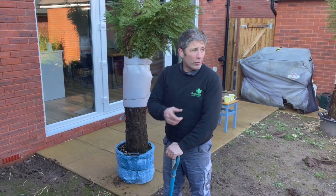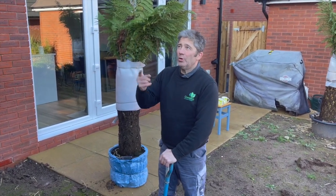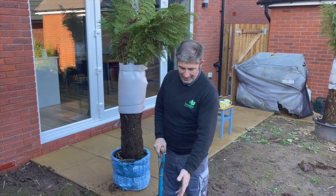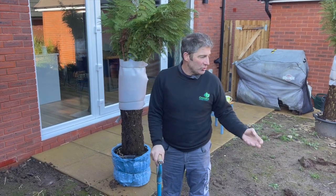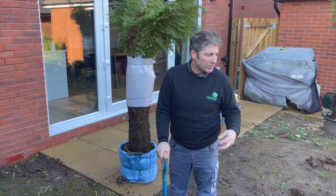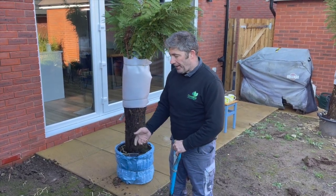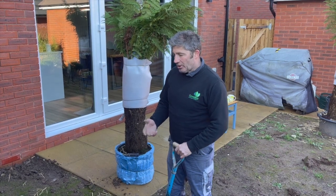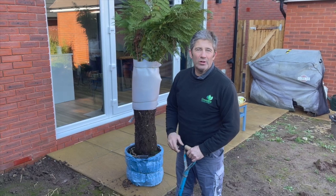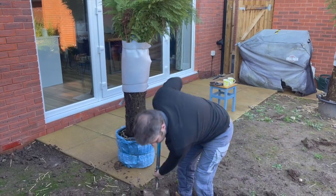Of course, I'm not sure what this site was on here, but sometimes on general commercial sites like this they would have recycled products put in the ground. But look how deep this is. This isn't bad soil. It needs some grit in there, some sharp sand, some humus-rich soil, some composting to liven it up. But it's good ground. Nevertheless, this is why patios move, because the contractor will say, yeah, I went down 100 mil. But to be honest, it's not good enough, is it? Not really, no.